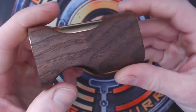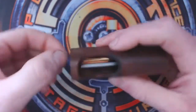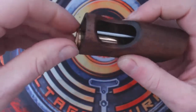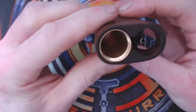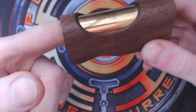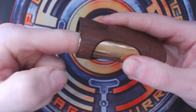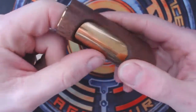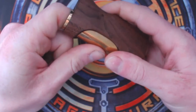To start with, remove the bottle and take the battery cap off — you can just use your fingers for this or a coin. Then what you need to do is put your finger inside the battery tube and basically give it a twist. Use the wedge of your finger; wedge it in there and as you pull your finger out, give it a little twist.